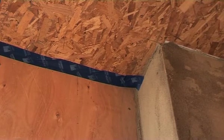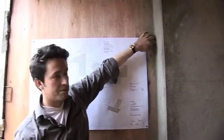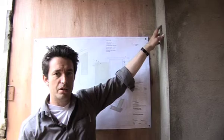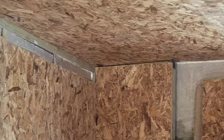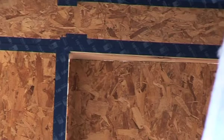You can see the blue tapes and you can just see the remnants of tape between dry and wet construction. Everywhere on the job there's this continuity being maintained from one surface to the next to achieve complete air-tightness. We hope to get below one air change per hour at a pressure test of 50 pascals on this project, which is still very unusual for retrofit.